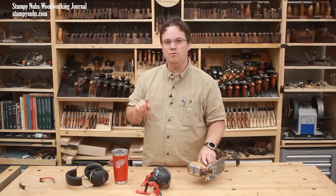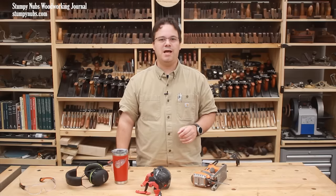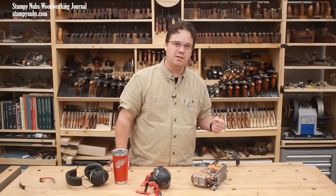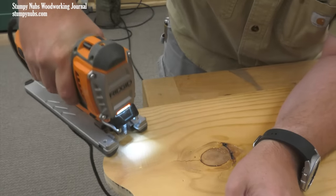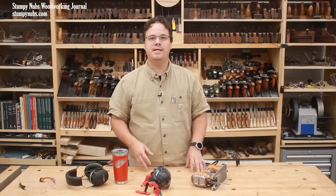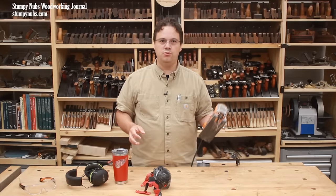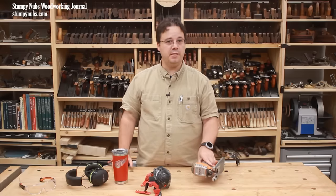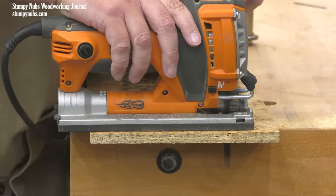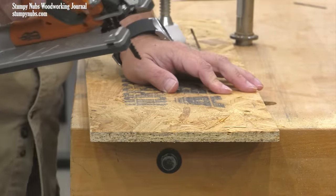Because the blade moves up and down rather than in a circular motion, a jigsaw is unlikely to violently kick back out of a cut like a circular saw might, but it can bounce upward if you use poor technique. Perhaps the greatest danger comes at the end of the cut when some folks grow impatient and try to withdraw the tool before it stops its reciprocating motion. The end of the blade can then catch on and damage the workpiece or even a hand placed carelessly nearby.